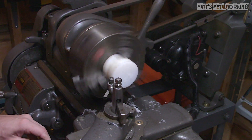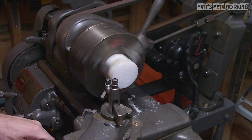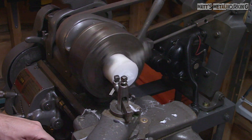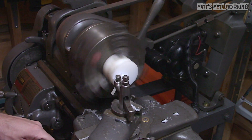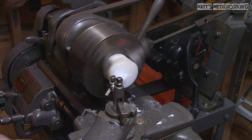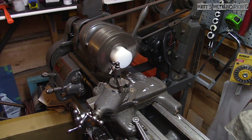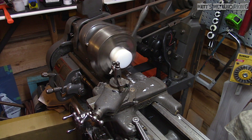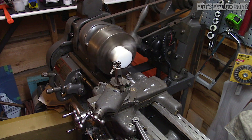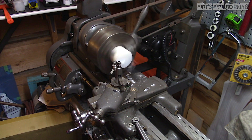Cleaning up the ends by facing them on the lathe. Keep the lathe speed high. First roughing in the surface manually, ensuring it's square — 20 thou cuts to start, running at 600 RPM. Make sure your tool bit is sharp; here I'm using HSS. Nylon gets very stringy especially when making heavy cuts. A chip breaker doesn't work here, so the only real way of breaking the strand is by stopping your feed. I don't recommend breaking it by hand while the machine is on as you may hurt yourself. As a final cut I set up the power cross feed at a lower rate, about 2 thou feed rate, with a last cut of 5 thou, which achieves a smooth finish. This can be one solid cut — the strand will be very hair-like thin and breaks away very easily. I'm not using any cutting fluid for this either.